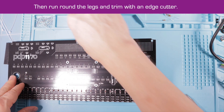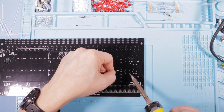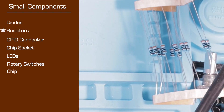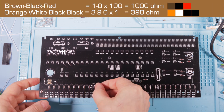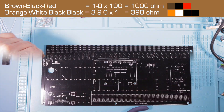When we've been around all of our diodes, we can move on to the resistors. There are two types: you'll use six of these 1K jobs and then a block of 12 390-ohm resistors. I always forget the color code, so I've put up a guide for you. As before, I'm doing them all in one go, taping them up and batching through the soldering.